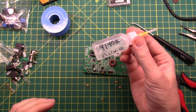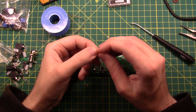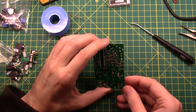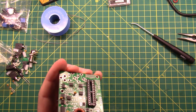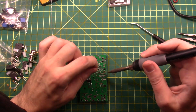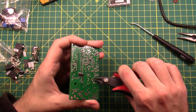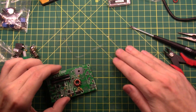I used this little bottle with its tiny applicator because otherwise I'd pour a whole bunch on. Now that hole is cleaned out, I start loading up the holes, double-check orientation — 474, 474, 474 looks good. It's getting tight in there, so I cut off all the leads that have already been soldered. Another set down.